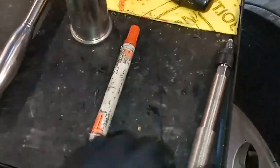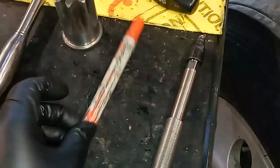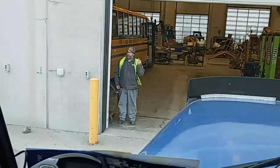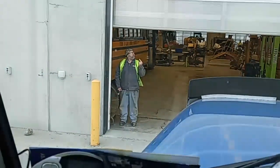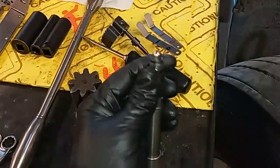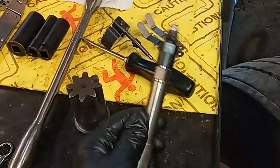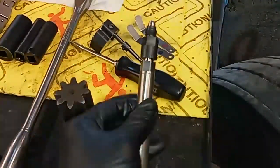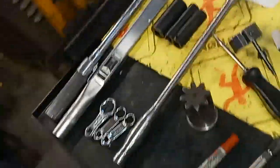One of the hardest parts of this is trying to pin the engine by yourself. There's an actual CAT tool that's a spring-loaded pinning tool — from CAT it's about $300 — but this one I got on Amazon for about $25, which is less than one-tenth the price. I'm also showing the turning tool here, though I'm not actually going to be using it.